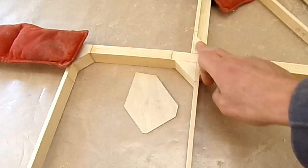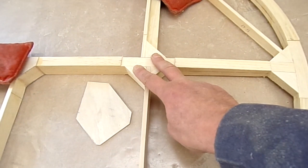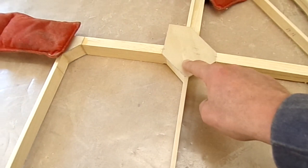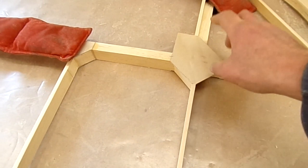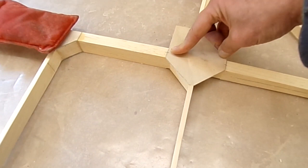I've routed the two areas here on the rudder to take the inset gussets, and the gussets will fit quite nicely like that. The grain on this gusset is going differently to the other ones on the spar — the two surface sections are going in this direction. That is to tie the front and rear rib together across the spar and also to allow for a little bit of flex required because of the change in angle from the spar to this upper section.